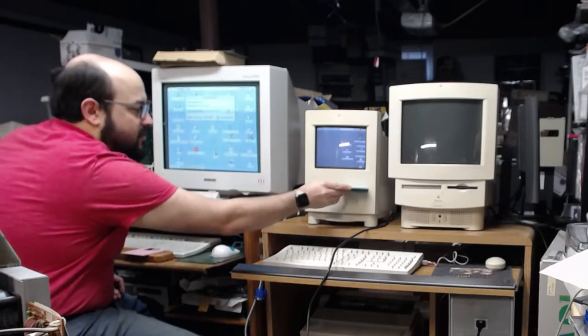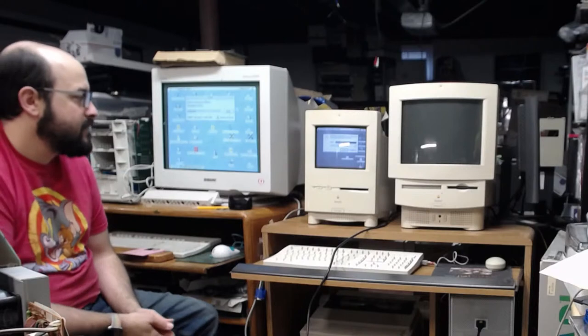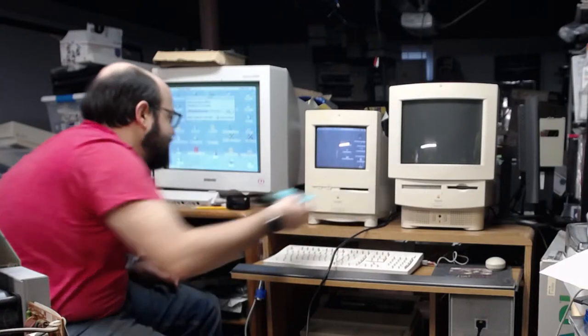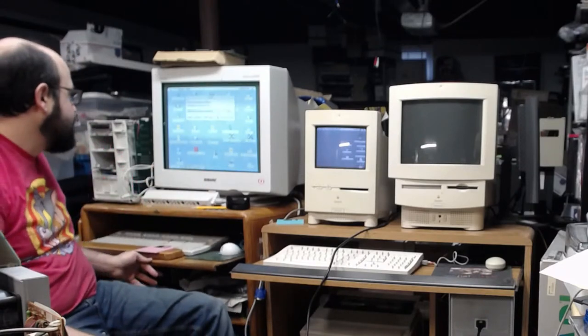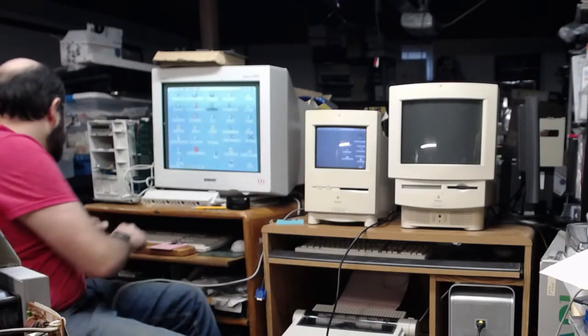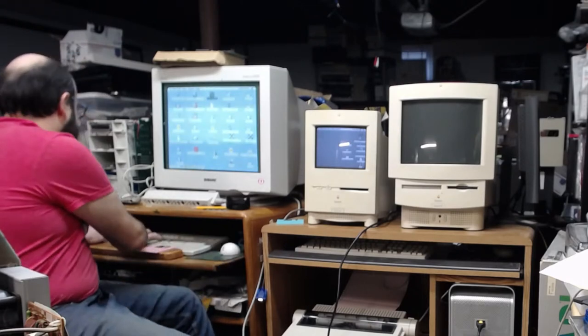And let's see if there's anything on this floppy. Oh, this floppy drive is a little sticky. That's right. Alright, so it doesn't like that disk. Oh boy. Really? Oh boy. Yeah, maybe if floppy disks aren't going to be the solution here, maybe we'll just do a local network connection, huh? We will borrow the serial cable out of our friend, the image writer here. Because with a Mac, if you connect two serial cables together, you have an instant network. It's slow, but for how big is this file? Yeah, it's like a megabyte or so. Yeah, 889K, that will be plenty fast, so.